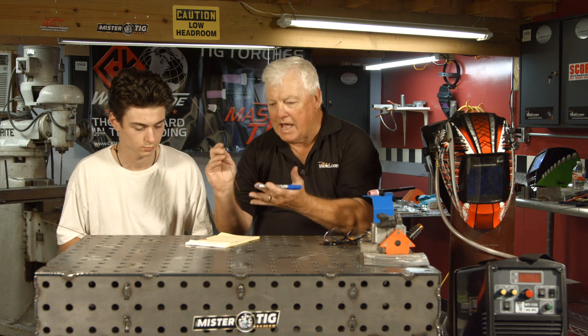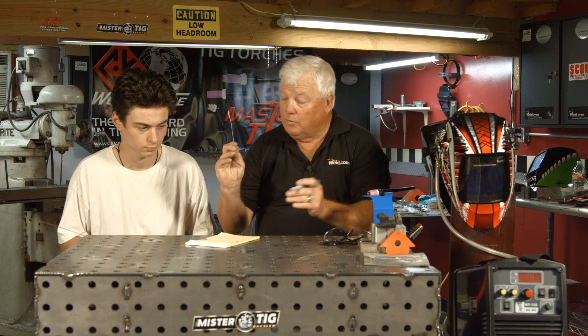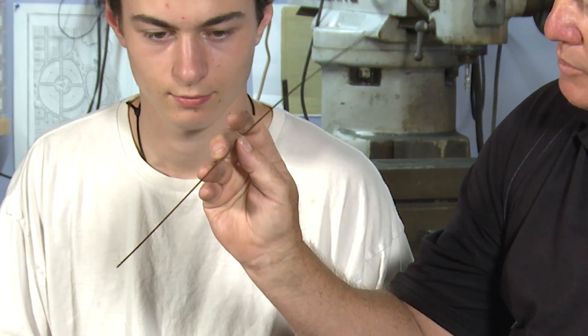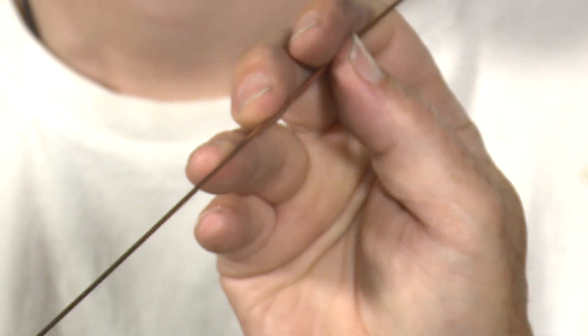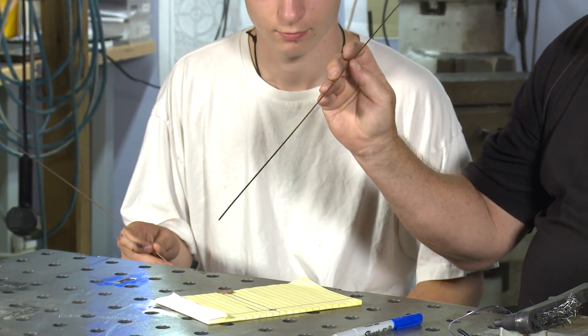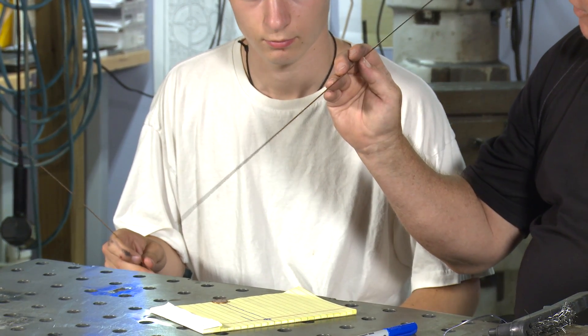That's just one of many techniques for adding filler material. You'll learn to TIG weld and get pretty good, pretty quick — and then you're going to plateau. You won't get any better until you learn the ratcheting technique. I keep these three fingers and one finger is always indexing, so just practice it over and over. Pretty soon you'll be able to add the entire length of the rod. If you're watching a movie and you set your rod down, when you come back decide which hand you were using — otherwise you become ambidextrous and can add a rod with either hand.